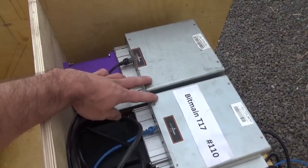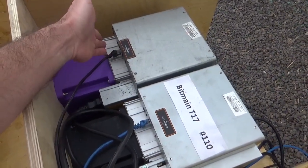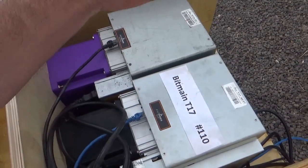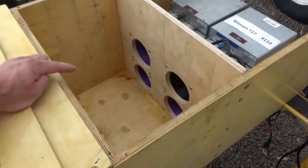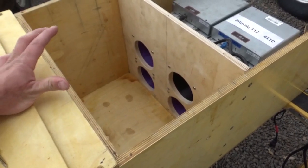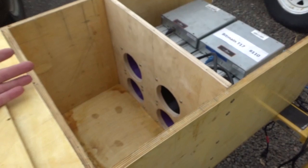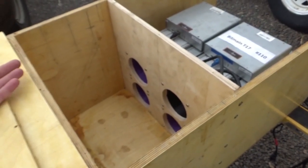Because of the form factor of these cases, it's quite difficult to put them directly flush with the bulkhead. In this configuration it makes everything cleaner and the air flows in the original factory direction. I also removed the baffle that was in the center section — from my experience it was not needed, because of the different heat sink design on these miners. I did not have any issues with the high-pitched whistling that existed with the S9s.